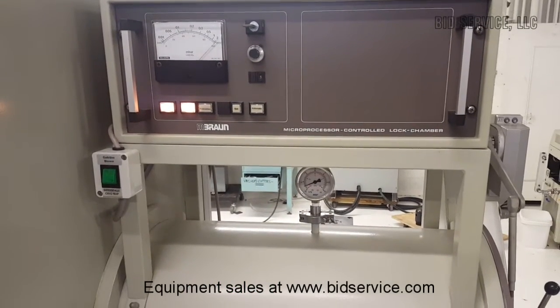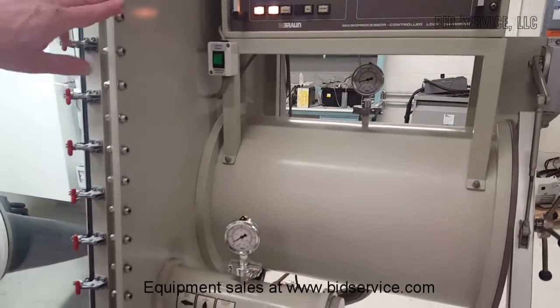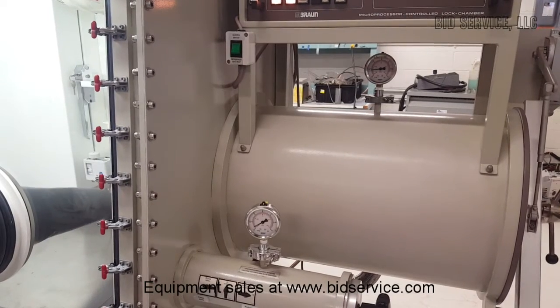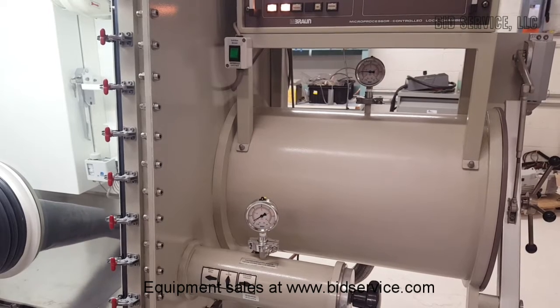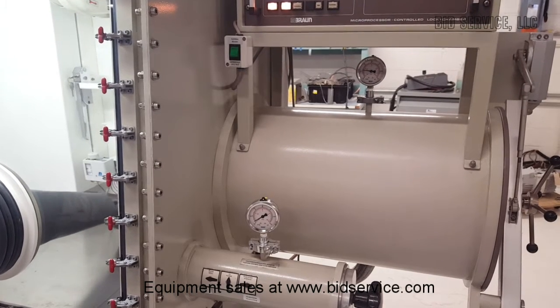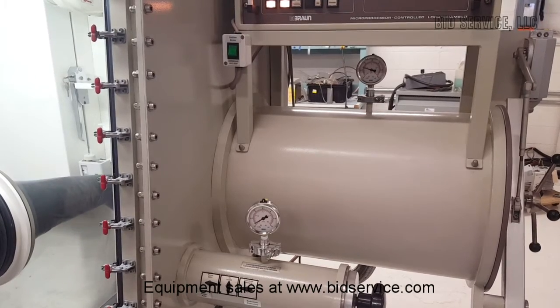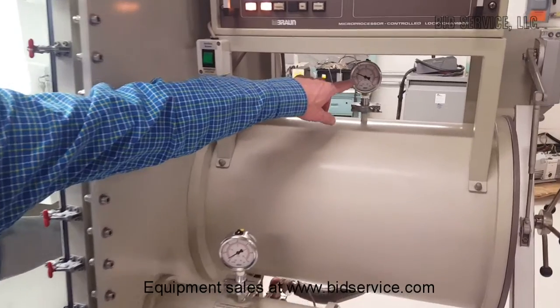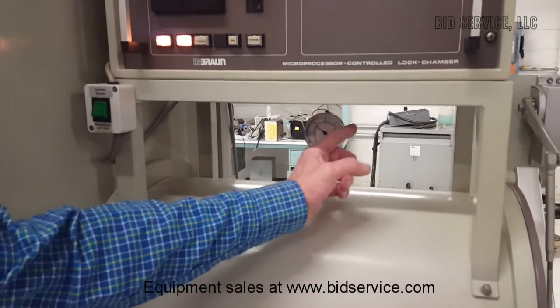You can see it's bringing the gas from inside the box. It's interlocked so that if you go out of your pressure range, it'll stop refilling and allow the inside box to come back up to the proper pressure. That's why you hear that cycling of the valves right now. We do have a gauge here to show you what the pressure is inside the antechamber — so it's making its way back up to zero.